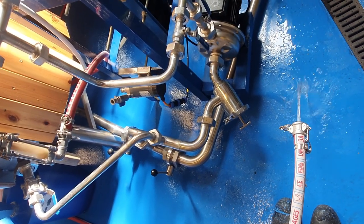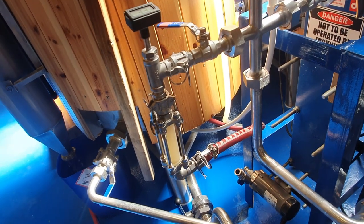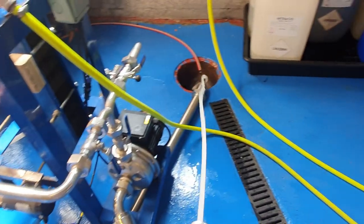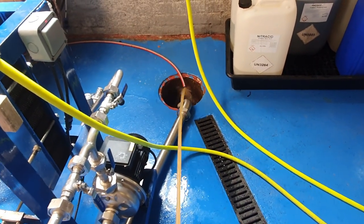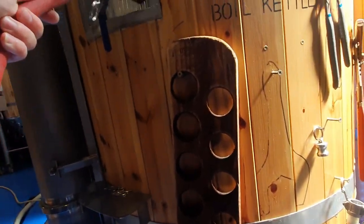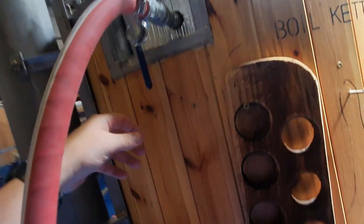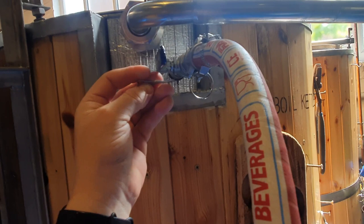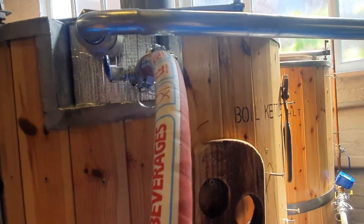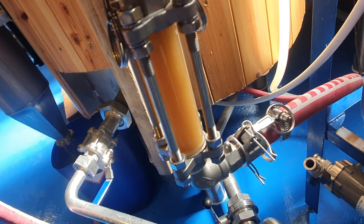Normally I'm doing this two-handed. So we're going to open the back of the plate chiller, the front of the plate chiller, and then as I open this valve here, we're going to see the acid come out of there and also the acid coming through here. So we're sending the acid out of the plate chiller — you'll see in the sight glass the acid's coming out — and then it's just changed over to beer. The trick is to time this right: when that turns to beer like it just has done, we turn it off. Then we're going to hook it up to the boil kettle, just like that. Open that valve and pop some safety pins in the cam lock to prevent any nasty accidents, because we are dealing with boiling hot wort now and you've got to be careful.